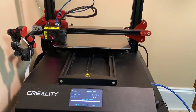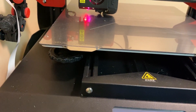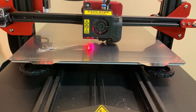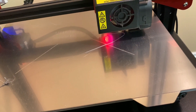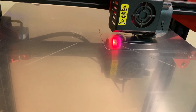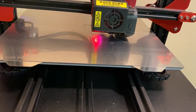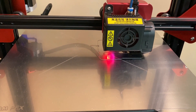Let's see if this print succeeds on the first layer. The only thing I'm kind of worried about is whether it has good adhesion or not. Still starting the sequence. That's not supposed to happen — that's not bed leveled. And it looks like we have success. If you feel like you've bed leveled a whole bunch, lower the offset a little bit. Mine's kind of lowered a lot, but it works. It's doing well. Kind of lost some string in the beginning, which bothers me, but it should be fine.